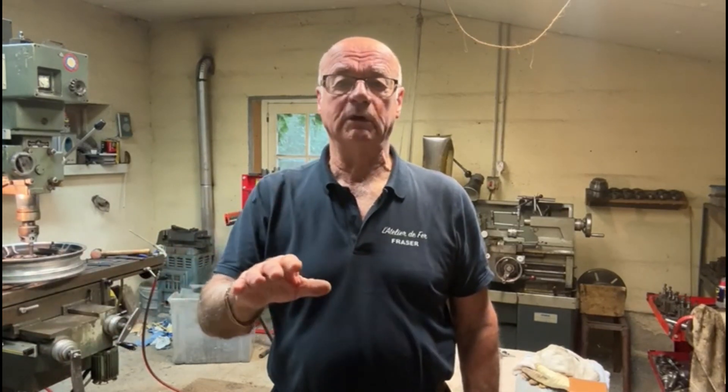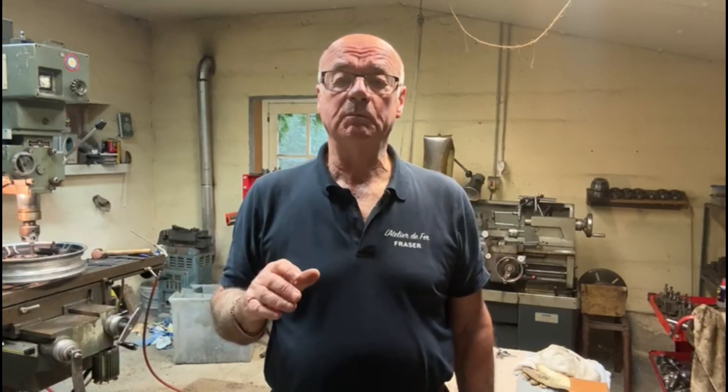Hello again and welcome to my channel. I'm Fraser from Metalworking in France. A little project I've got on today is a rear wheel off a motorcycle. The bearing has gone really really slack — in fact it rattles around inside at the moment. I've set it up on the milling machine already. I've got to bore it out basically and put a sleeve in so we can refit the bearing, boring it out so it's nice and true in the centre of the hub.